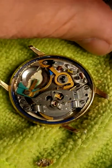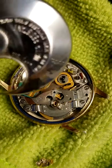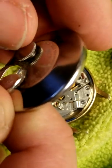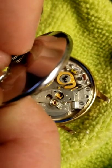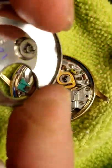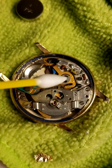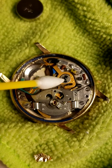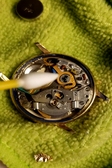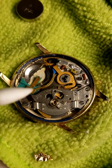The first thing I learned is that the crown is actually attached to the lid. To activate it I can pop it up — you should hear that tick tick tick. So the mechanism is all one piece for the crown. It pushes into this little piece here, and when it's up there's no current going through it, which is very common with the electric Timex watches. When it's down, current goes through it and the pendulum should work.